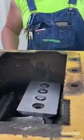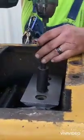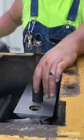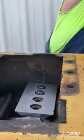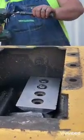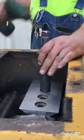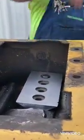Don't ever use the bolts over again. Once you flip them, you can use them when you flip them, but after that discard them, because when you tighten them down they stretch, and after that second time there's a chance of them backing out. And you don't want metal getting thrown at you. That would not be safe. No, not fun at all.